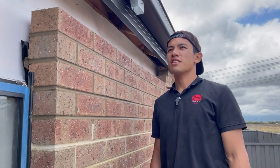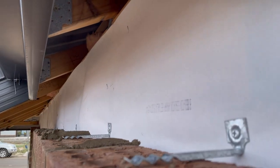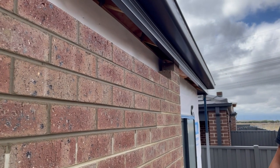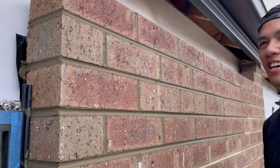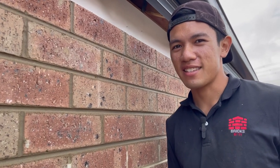Alright guys, the ties are on and screwed on as you can see. The brickwork is done — joined, brushed, scraped, dry sponged, wet sponged, hard brushed — the whole lot. So now we're going to do the last two fascia courses, and then sort of take the scaffold down. If you guys have been following our channel for the past three months, you'll notice all our jobs have been on the fascia, but this is our first job with eaves.